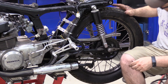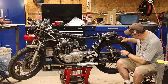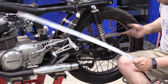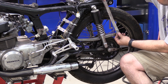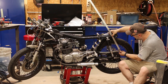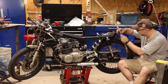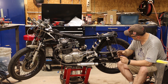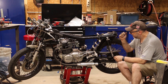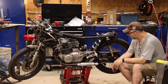I really like the swoopy, retro look — I think it kind of fits the bike. It's really pretty sturdy just as it is, but I'm going to take a piece of steel up to this hole and drill another hole in my sprocket guard to keep it from going down. That's not going anywhere — that's going to be good and sturdy. That's just two more holes, hopefully just an 8mm. Then I can clean this up and paint it along with the bracket I did for the steering damper.